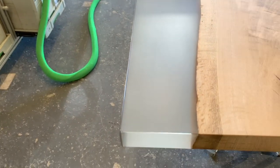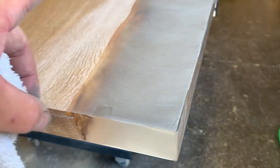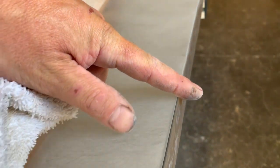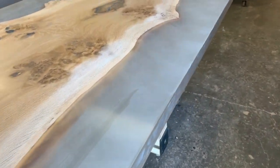The joint is absolutely superb. It's a shame I've just sanded this matte again to experiment, but you'll see it gloss at some point. The cast on the end is really killer — check that out, I'm absolutely loving it. It's a very labor-intensive process: this was polished down, then cast with masking tape, then I had to repolish the joint and very carefully polish this edge — not with a router bit, but actually polished round with sandpaper.